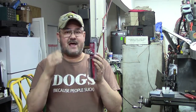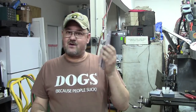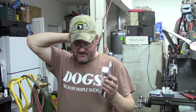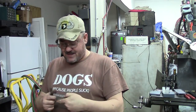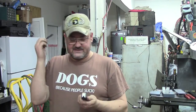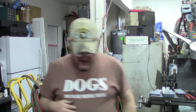You can generally find them. They're common available sizes — not oddball stuff. Sometimes guys will sell these and keep the bit, but they're common sizes and you can get them pretty easily. So same thing as before, we're going to be using a Big Gator drill and tap guide. This is the bigger one that goes from three-eighths to half, because this is a 25/64ths drill bit we're going to be doing — just wash, rinse, repeat what we did a while ago.